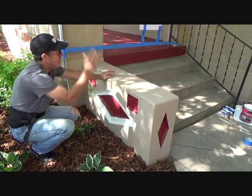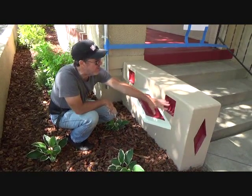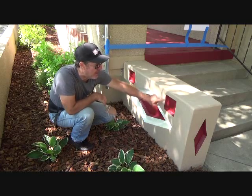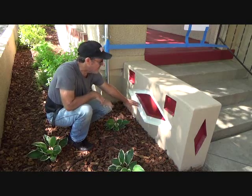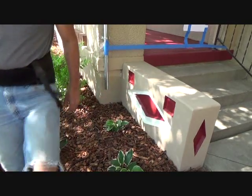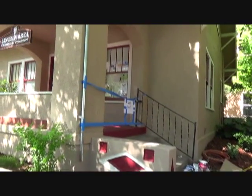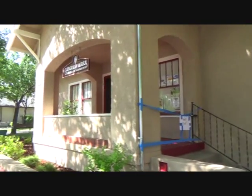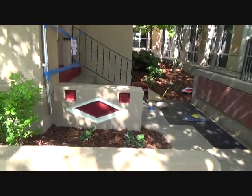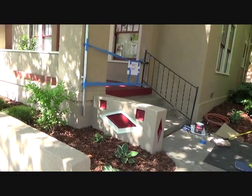This is what I did a couple of days ago. This wall wasn't painted — the painters got here and painted all the walls and everything on the building, and they forgot to do this wall. So they asked me, 'Hey Joe, can you come out here and do this?' I used a two-inch brush and did the reds first. I cut in and made it just beyond the edge a little bit, then after those dried I did the white. Then after the white dried, I came back the next day and did the body — two coats of everything. If you've got a little wall like that, you always want to look at the existing conditions and kind of mimic that, so it blends in. You've got nice red around the windows, the white, and a red screen door. It just added a little bit of character — it took a little extra time to do the red inserts, but if you've got a chance to do something like that, do it.